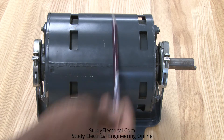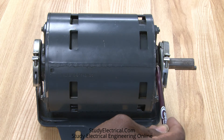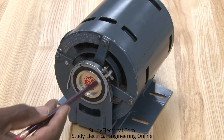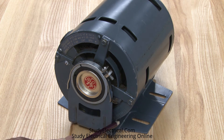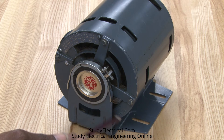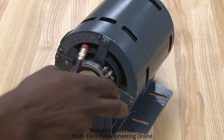The outside of this motor is where the stator is located, where the coil on the inside is. These are the end bells on this side and also this side. This type of motor is called a resilient mounted motor — it has these resilient rings around it made out of rubber with a metal ring. The motor is supported by the cradle, and the resilient rings make the motor very quiet because they absorb the vibration and noise before it sits into the cradle.